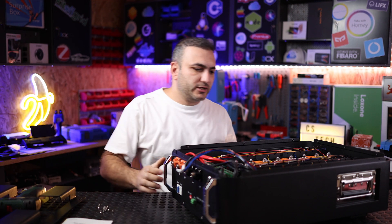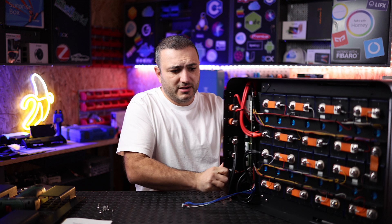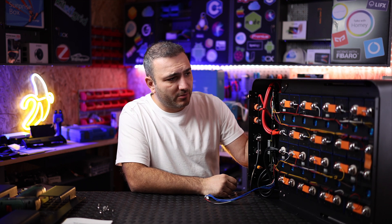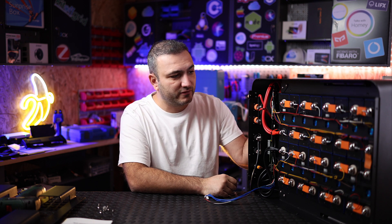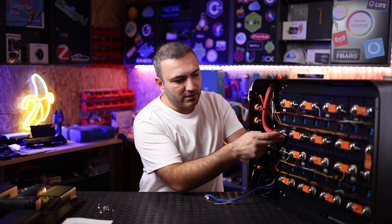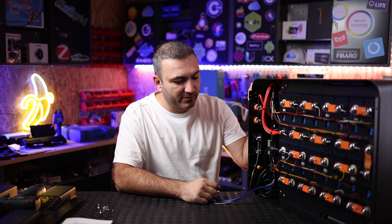Now I'm going to turn this battery around because it is very heavy, to explain what you will find inside. First, let's talk about chemistry. The chemistry inside is lithium iron phosphate — it is specially made for solar systems and storage solutions because it has a low energy density per cell. Basically the cells are bigger, heavier, and store a smaller amount of energy, which makes them safer.